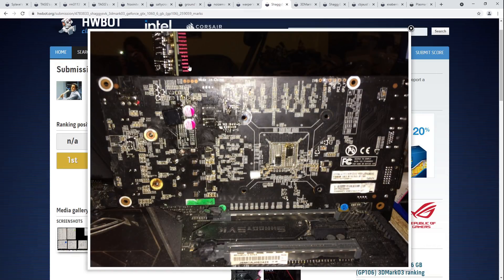On paper it sounds super simple — you just replace the VRM and run power and ground wires — but in practice it gets very, very complicated. It turns out that where exactly you choose to connect your ground, where exactly you connect your V-Core, and how you connect it, makes huge differences to how well this modification works. Then of course you also have to convince the card that everything is fine and just turn on — that's always a fun part of e-powers. And we've also got some cap mods hanging out on the board.